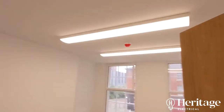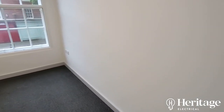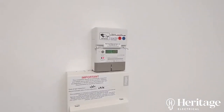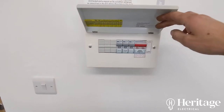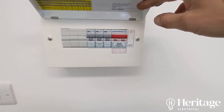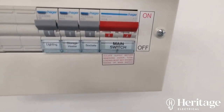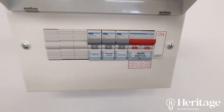We've got these nice bright colour-temperature-changeable LED buttons. You can see the original wooden windows on the outside, which shows the depth the room-within-a-room comes to — there are actually double-glazed windows installed inside. Each studio is fully carpeted. We've installed Hager consumer units in each room, and each room has its own card meter to allow tenants to top up their electricity and allow landlords to manage how much has been used.